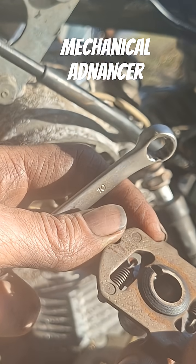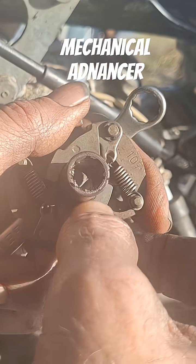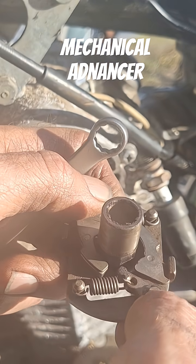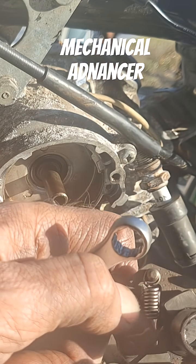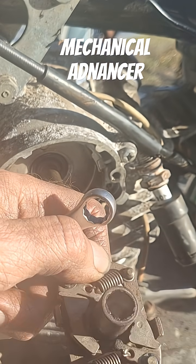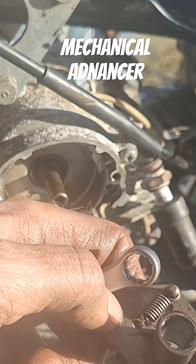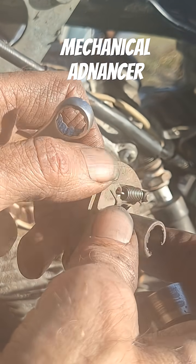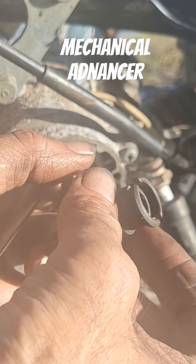Where the pins go in, where the arms sit — make sure they're not wiggling around at the pivot points, like here and here. Sometimes you get them where they're absolutely worn out. You want to be able to move these back and forth fairly easily. I'll pull these weights off — this one and this one — and lube the points here and here, and here and here on the plate. Then make sure this is lubed up, and when you go back together with it, you want it to spin freely on here.